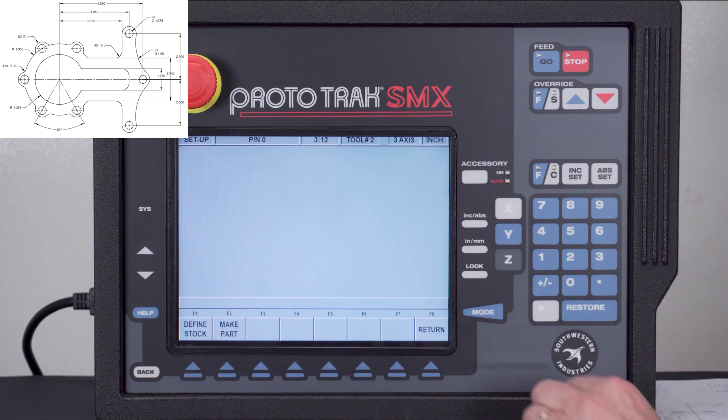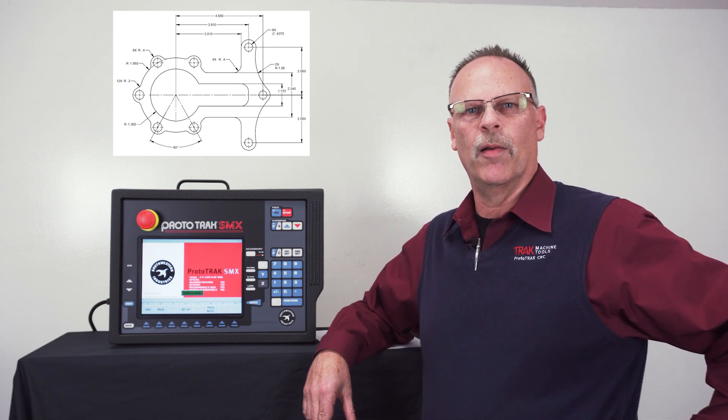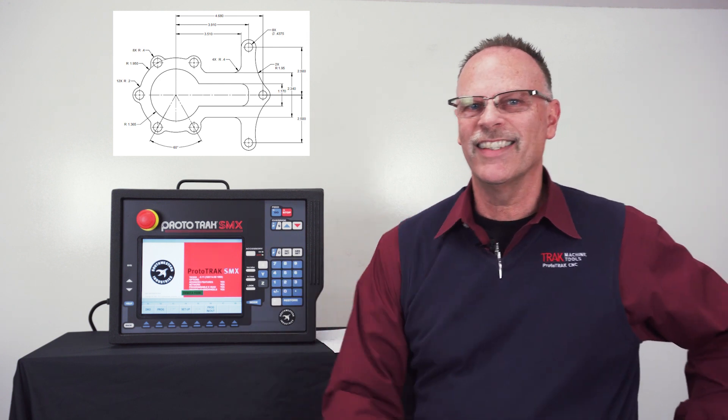I'll exit from here, and the last thing I would do is save this program or move into the next part. Notice that I used subroutines for my repeats and rotates to get the holes where I wanted, and then I used copy to give me new pieces that I could change. That's the difference: in a subroutine everything stays inside one event that you're repeating, mirroring, or rotating. When I use copy I get all new pieces so I can manipulate them without changing the original parts. Knowing how to use the proper subroutines and copies in the right places will shorten the amount of programming you need. In part two you're going to see how to do irregular pockets and profiles, and I'll also show how to use mirror image. Until then, I'll see you in the next video — and as always, don't forget to keep on tracking.